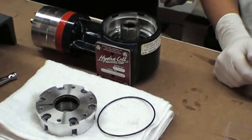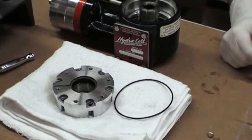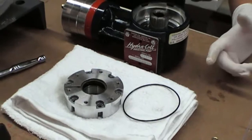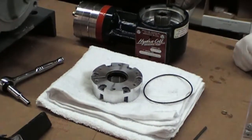That could also be the source of the issue. If, as you're taking them out, you notice any of them are loose, tighten them first. And finally, since you already have it unassembled at this point, it may be a good idea to go ahead and replace the large O-ring just to check to see if that potentially solves the problem as well. Now we'll go back over how to reassemble the pump.